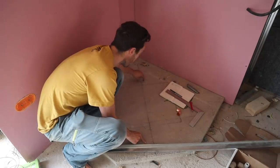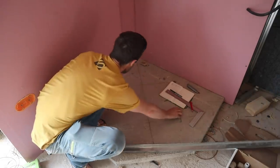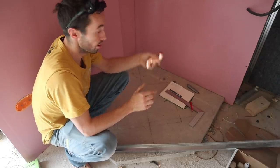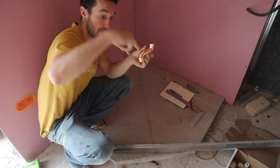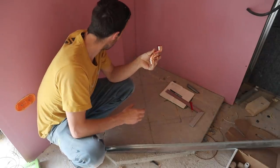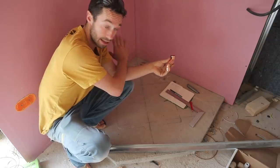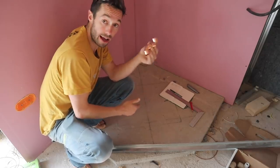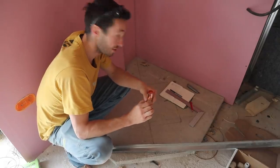And I basically need to get a perfectly shaped bend to give this curve. I can have them both the same height, and then where they come down on the inside of the plasterboard, on the top one I'll put a little bend like this to get out of the way. Then they'll come down together parallel, and I just have to work out the heights I want for them. Then I'll be able to put them through the walls, put in the plasterboard, cut all the holes in it, finish the boards, and then put down the tiles, ready for getting the fire on and soldering these into the fire. I've got a pipe bender, but it doesn't actually do 28, so I just have to figure it out.